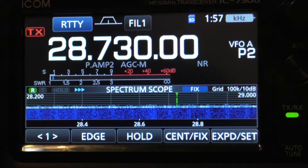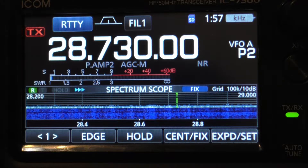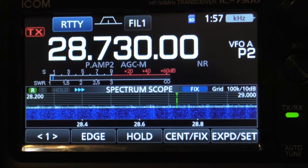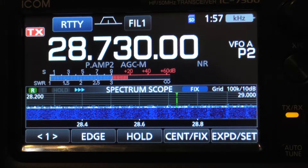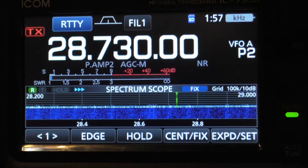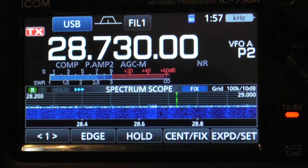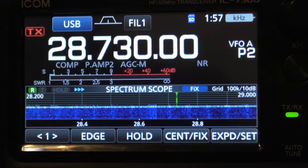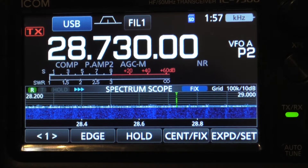I'm trying to run the tuner — the automatic antenna tuner — and it just won't load at 100 watts. That's because the SWR is a 5 to 1 ratio. Let's go over to the Yaesu FT710.